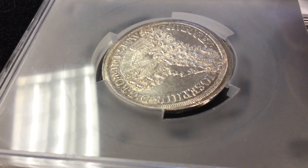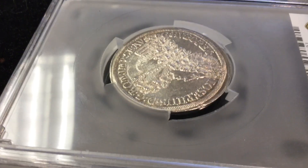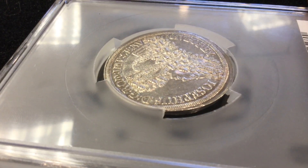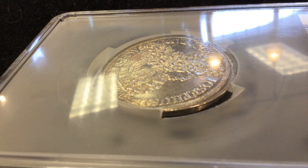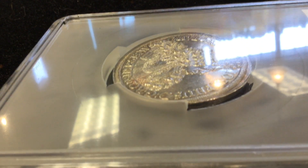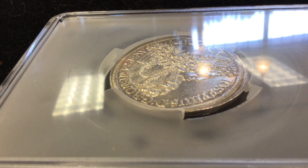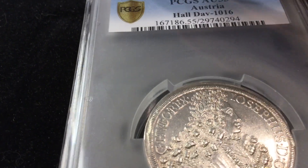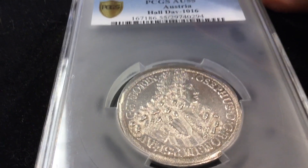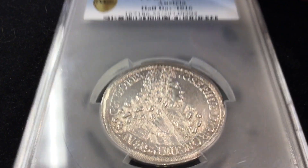Another unique thing is timing those dies to strike the coin, and then when it's out of the press it's literally sawed out instead of stamped out. It may be difficult to see here, but you can see striations where the saw marks are, and there's an indentation there that tells you this was one of the end pieces from which it was sawed. This process was fairly common in the 1600s and early 1700s for many European mints.